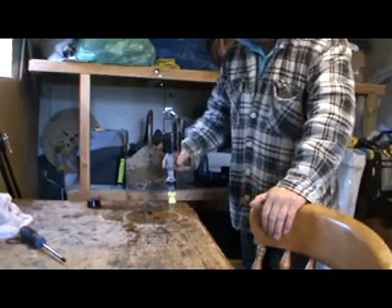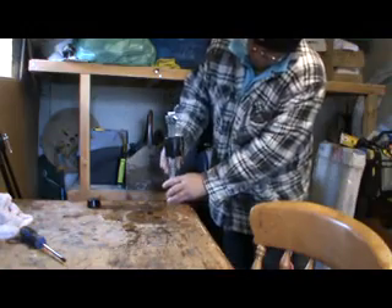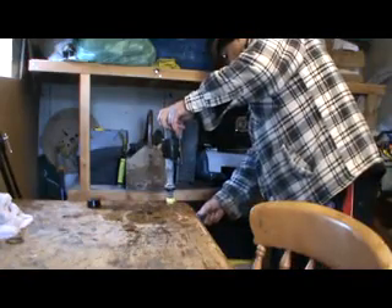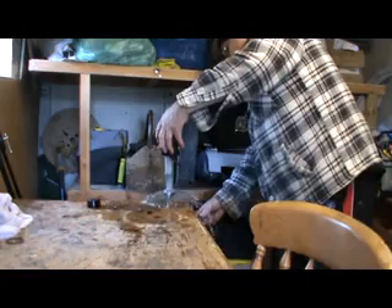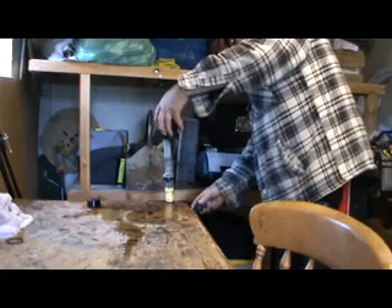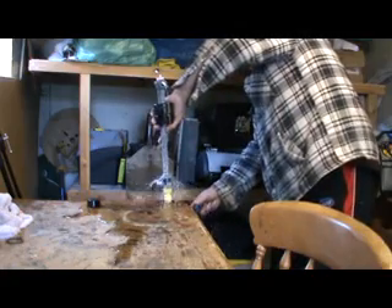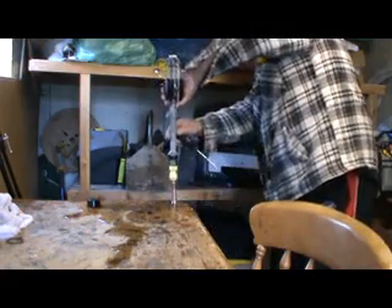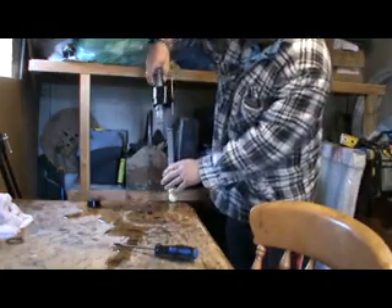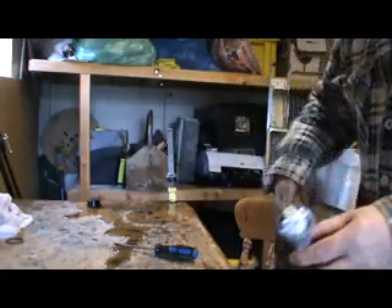The thing you've got to watch out for when you're changing these is to make sure the locking ring is on. I'll show you what'll happen if it isn't. You turn the water on and the water will blow off the top bit — just get ready to turn it off — and they'll go everywhere. That can shoot across your whole bathroom. That's one thing you must do: make sure that locking ring is at home when you fit them in.